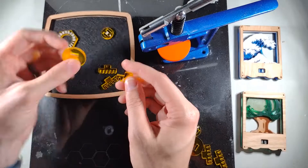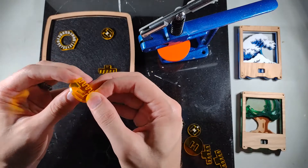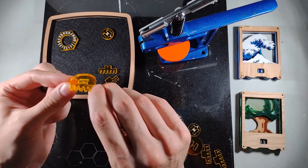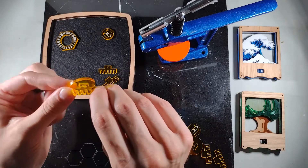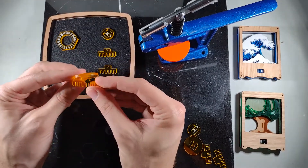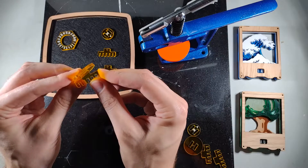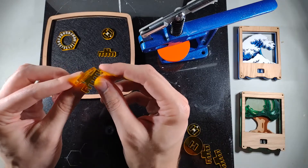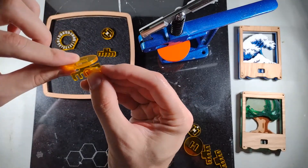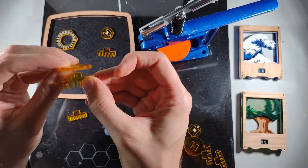This slot right here is a slightly different size than the piece — you can see it doesn't really slide in, and that's intentional. That's part of a press fit tolerance: making it so that these pieces don't just slide together. We want them to stay together after we put it together. The wedge helps guide it in, because without it there's always going to be a corner out and it's going to press together at an angle. This makes sure there's at least one corner from each end in there and it'll go in a lot smoother.